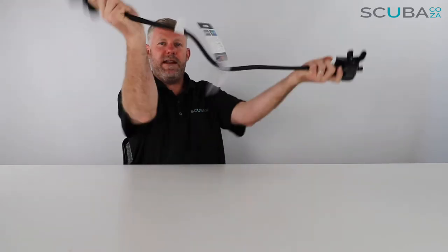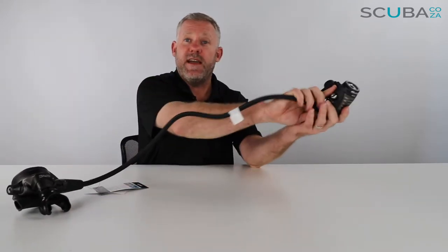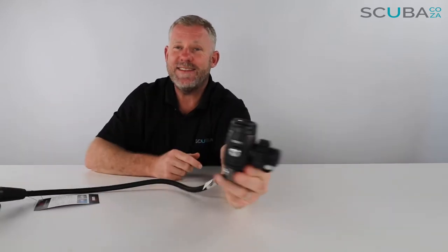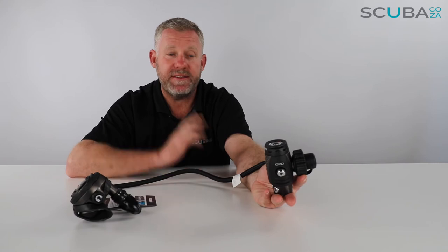This is really the top-of-the-range unit — in Afrikaans they would refer to this as the 'Munir,' and in Zulu they would refer to it as the 'Makulu Boss,' Makulu meaning big daddy — the how's-your-father of all regulators. Let's start with the first stage and work our way down to the second stage. The first stage is the Mares 82X, and it's a really big air system compared to all the others, because it has a lot going on inside and needs to perform at super deep depths. You could use this whole setup as a full tech setup to dive trimix if cleaned correctly, but as it stands here it's set up as a recreational unit to dive up to 40% oxygen or nitrox mix.